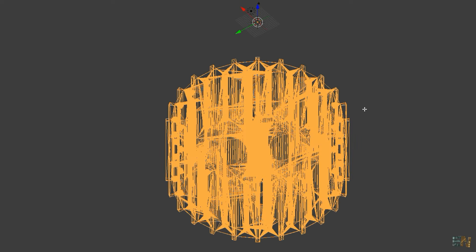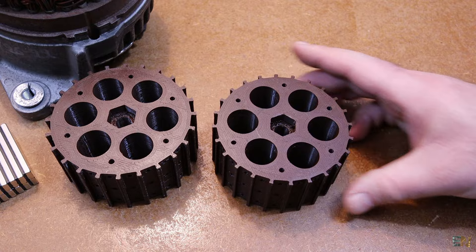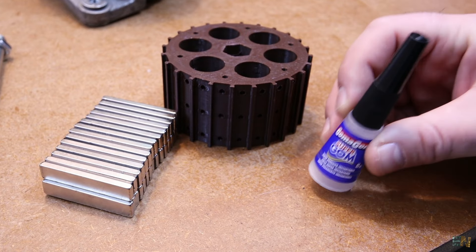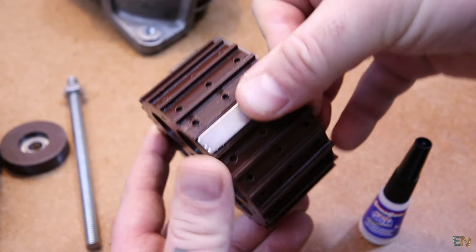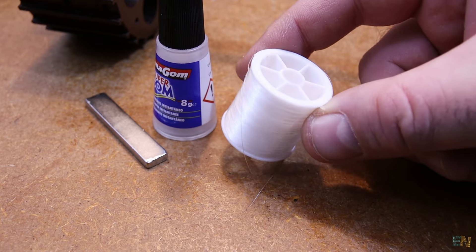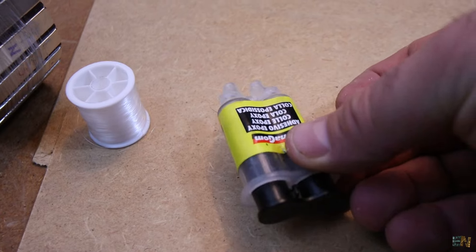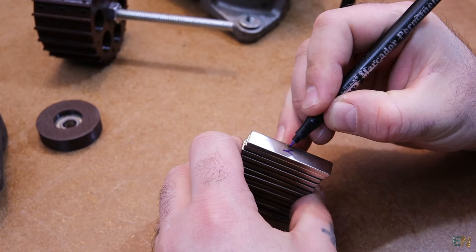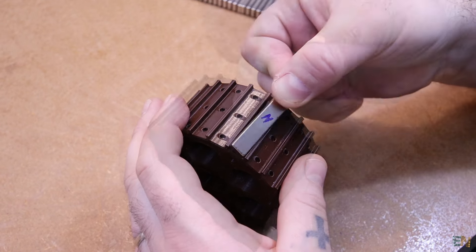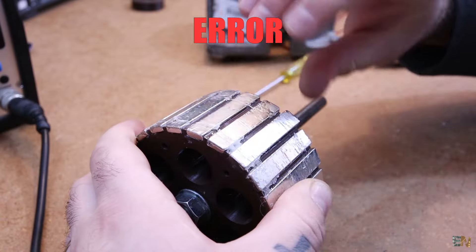Next I measure the space for the rotor. I will use these magnets: 5cm long, 1cm wide and 3mm thick. The original rotor has 12 poles, but I will use 24 magnets in pairs because I don't have magnets that are that big. In Blender I create the main shape of the rotor, then create the magnet and multiply it by 24, separated 15 degrees from each other, and subtract that from the rotor cylinder. Then I add the threaded rod hole and a few more holes for cooling. Now I have my rotor.